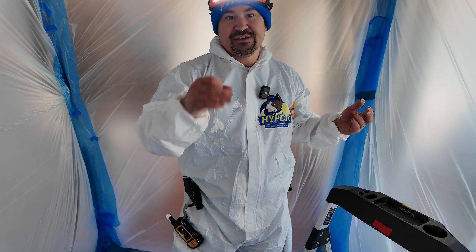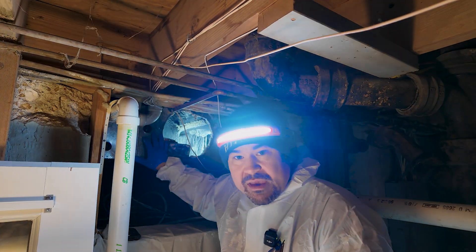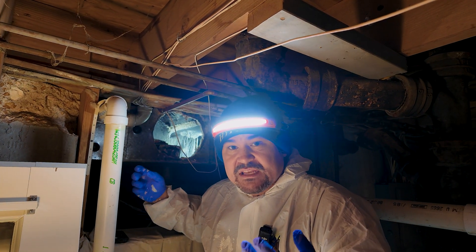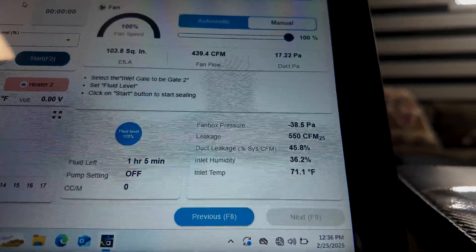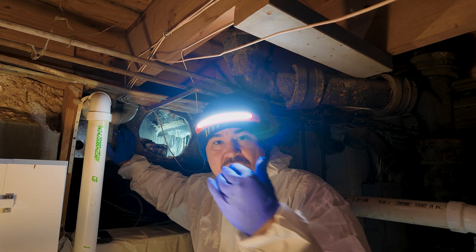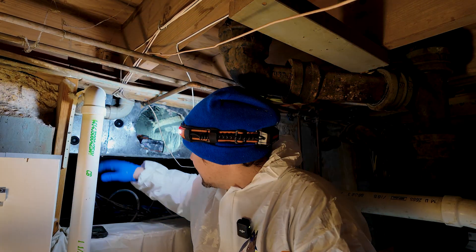That's how it's done. Now we're taking you down to phase three — the crawl space and the main lines in there. This is the last phase of the encapsulation process. There's a main line in the crawl space, and it gets moldy because it's surrounded by mud, dirt, rocks, and water. What we've done is hyper-sealed the duct work using Aeroseal, which is a patented technology. That has eliminated all the leaks that were previously pulling air from the crawl space directly into the ventilation system and distributing it through the home.